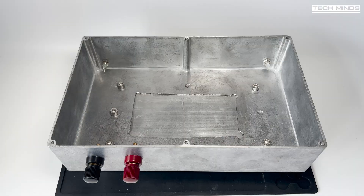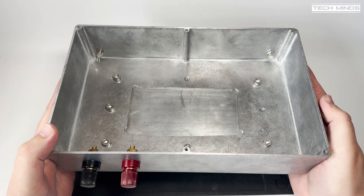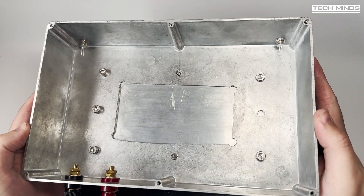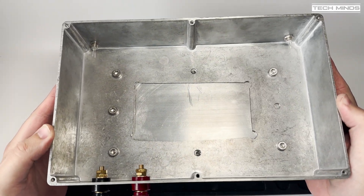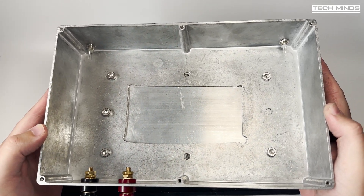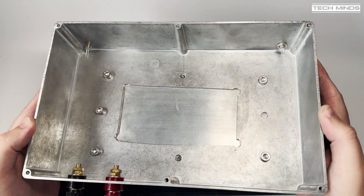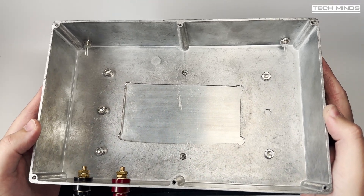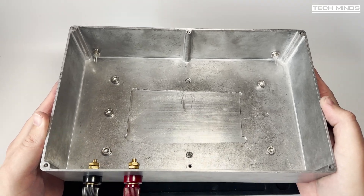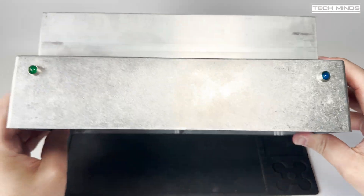This is how far I've got with the build: I've cut a hole in the bottom of the Hammond box, which is actually going to be the top, and then I've bolted the heat sink through the box. You may notice that the two holes in the middle appear to have something stuck in them — this is my first two mistakes with this build. Even after drilling pilot holes in the aluminium heatsink, I managed to snap two separate tapping drill bits. At the moment they're still in there, but I will need to look at a way to remove them soon.